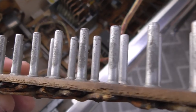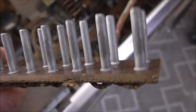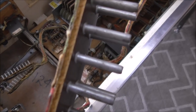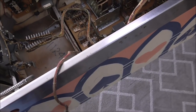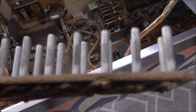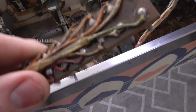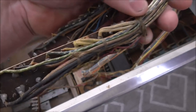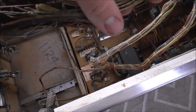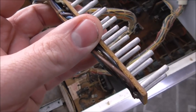See that corrosion? Is that oxidization? The reason it's worse on this side is because when it's mounted in the back box, that's the upside - so a lot of that is just dust. The bottom is not quite as bad because it's facing down. The other ones mount like this, so the top gets filthy. But you still need to clean them all. The way we clean them is just use really light sandpaper and get the grime off of it. Other people have other ways - do your favorite way.